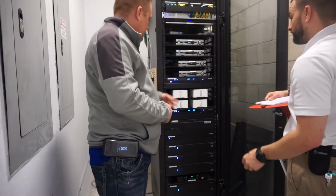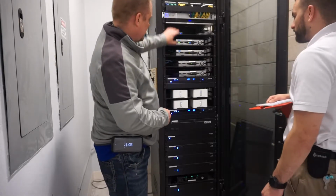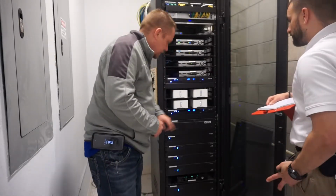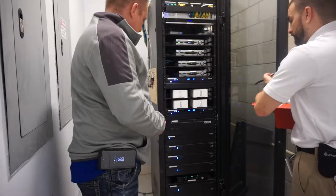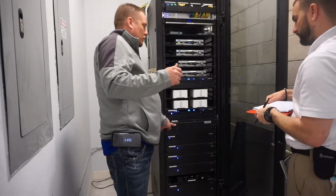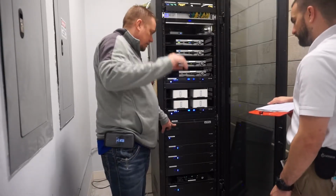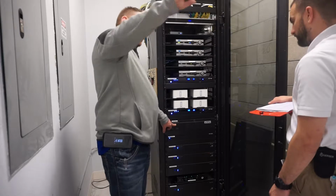You have two power conditioners in here, power conditioner 1 and 2. Basically everything up here is on this guy, everything down below is on this guy. This right here is your lock power supply. That's what actuates all the locks for the doors that feed back to this area. So that's going to be your east courtyard gate, all of that good stuff.